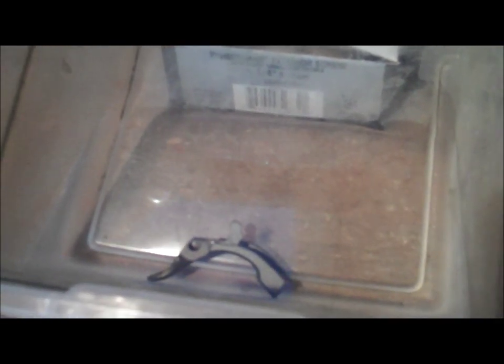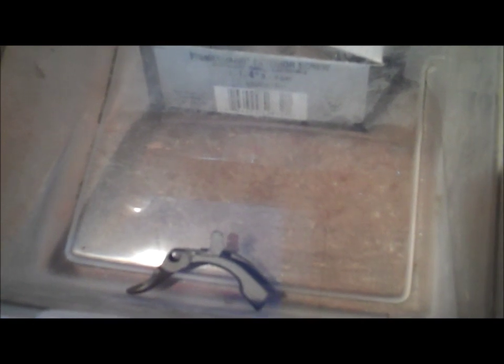It's definitely going to look good once it's properly done. So again, so far, you have degreasing, hanging it, and masking it off. In this case, I'm not going to mask it off because it's a small part and it's not going to show very much. If it was something like the slide stop on a 1911, then I'd mask off the part that would go into the gun. And then after that, you put it in the oven, bake it for a half hour at 250 degrees to get all the oil off. And then after that is when you sandblast.